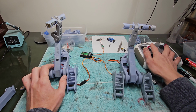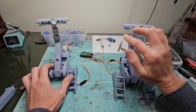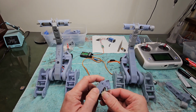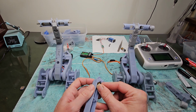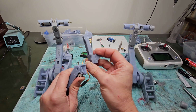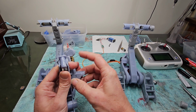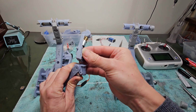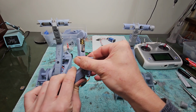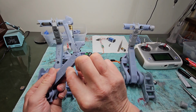But basically this is the RC one, so that's all manual, so wherever you move it, it's going to stop. There's no feedback, so you can't really control that with microprocessors and stuff like that. But basically how I'm doing this is just taking the N20 motor and popping it up the bottom of one of the torsos that I had to custom do, and then the chest, which is all done. It's all one piece. The front and back will just clip on with magnets, just so you can do all of your wiring in here and just cover it up. Works perfect. So that slips on down like that. You would do your screw up there, and that becomes your movement there and holds the motor all together. So that would be one section there, so just that whole one little screw holds all of this together.